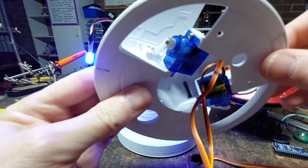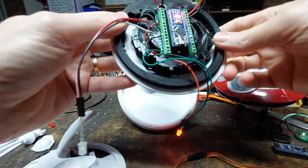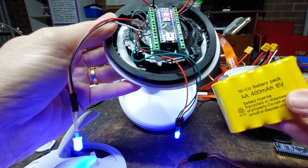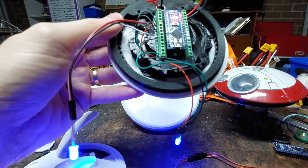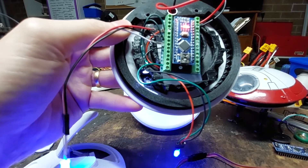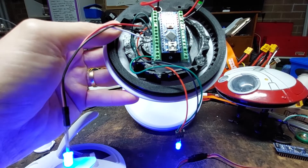Hopefully it's quite a simple, straightforward build. If you want to go further and make it more of a challenge, you can fit a battery in the body. You can work with Gary on the best options for batteries. NiCADs are great and they're safe, but they take up too much space. Lithium polymers are fine but they're not as safe. So we ended up going with a lithium ion battery — about 1500 milliamp hours — and that thing should probably run for 10 hours or more just doing the lights and LEDs.